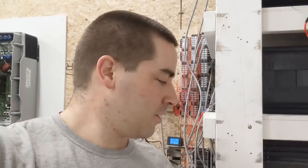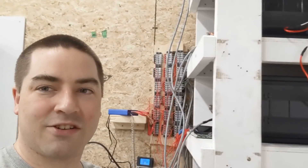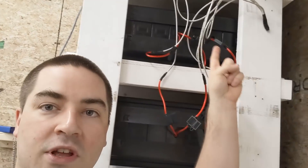Something I was asked about on my previous video was how much all this paralleling wiring actually helps — how much does it actually do for us? When I did my previous capacity tests, I didn't actually run the cells all the way down to zero percent state of charge or 2.5 volts; I was stopping it early. So I ran another capacity test stopping at the same point to get an exact number on how much this parallel wiring helped. Stopping the capacity test at 3 volts per cell, I was getting 22 kilowatt hours previously and I got 23.2 kilowatt hours after — so it added 1.2 kilowatt hours total to the whole pack.